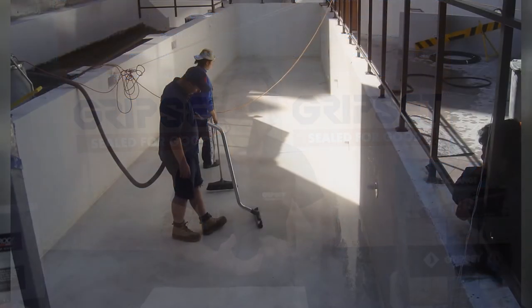There are new pools and retrofitted pools that need to be repaired. First, let's talk about the basics: surface prep for new swimming pools. You need to make sure the substrate is sound and stable. The concrete used in a pool structure may have additives as part of the design, and when those concrete areas are laid or shotcreted, residues can come to the top of the surface.